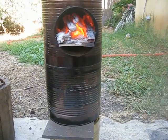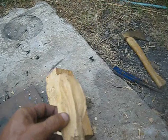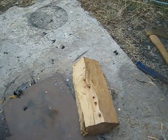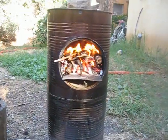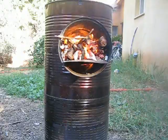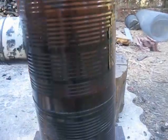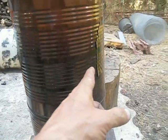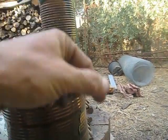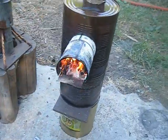Fire is burning, now only hot coals and charcoals — no smoke. The wood I'm using is just bits of cypress that I had here. One other reason why this stove works so well is that there are no baffles or interruptions inside the heat exchanger — the fire and hot gases exit the downdraft tube and go straight up to the chimney without any interference in the middle. This may be one of the reasons why this rocket stove works so well.